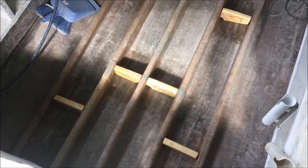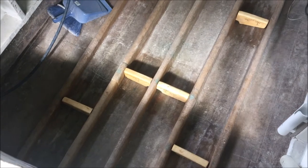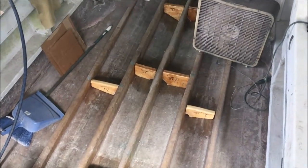I'm getting ready to go ahead and peanut butter in my bulkheads. I got them coated in resin last night, got the areas where they're going to go prepped out, and I'm hopefully going to get them in 1708 today. That way I'll be 95 to 99 percent done with the structural stuff underneath the deck. There's still a few areas I got to work out with the bilge and little drain holes and then some other things before I can put the deck down, but it's getting close and I'm so excited. This is the final layout of the bulkheads.